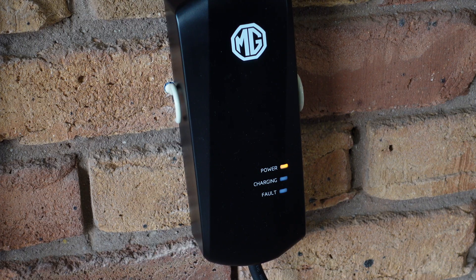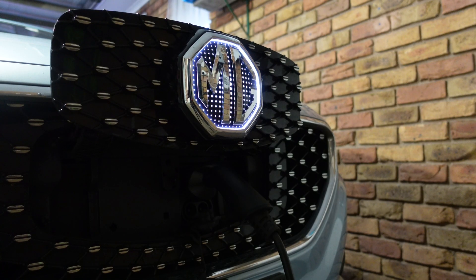The issue with using your slow granny charger is that your electrics might not be up to the job. These things draw current equivalent to a kettle — a kettle that runs for four, five, eight hours at a time. The power in this place might not be up to scratch. Think about the amount of heat generated by that — it's a real concern for fires and hazards. So when thinking about charging an EV with a slower charger, ask yourself: is this actually safe to do? I've seen people use extension cords — don't do that, it's a bad idea.